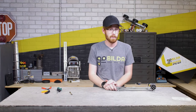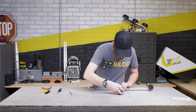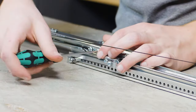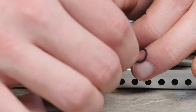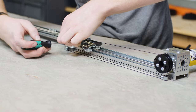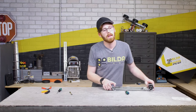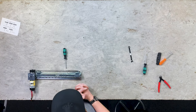If you're at the midpoint and don't have as much tension as you need, there are a couple of ways to go. If you just need a little more tension, undo this first bolt right here, take your loop, and move it to the next screw back here — that'll give you more tension. I like to be at the middle of the slide since that's where I'll have the least tension. Go back and hook it around the next screw, tighten the first screw, and just snug up the back screw so it doesn't fall out. We've increased the amount of tension — our guitar plays higher notes now. That's a pretty good way to tell: you can actually change the pitch you can make by vibrating those strings.